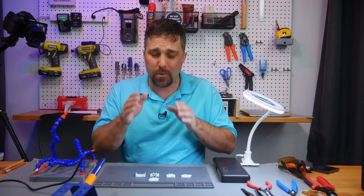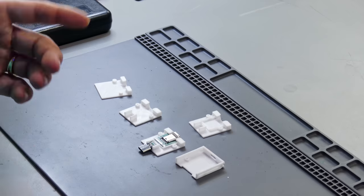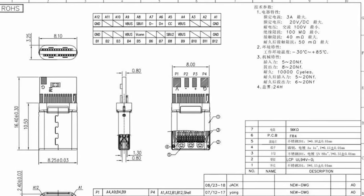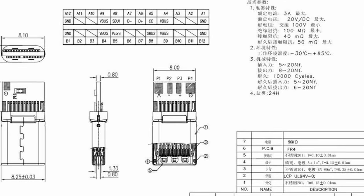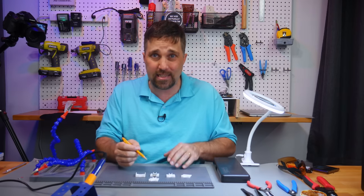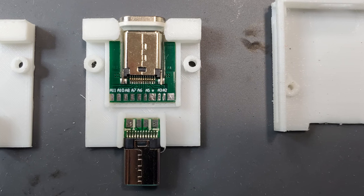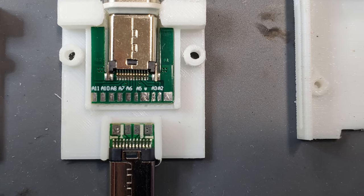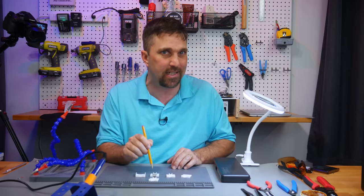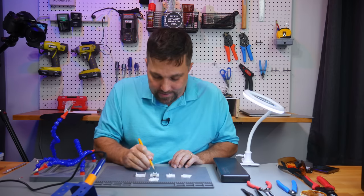I am going to make this work, but only partly because I'm using USB-C connections — they'll be connected as USB 2.0. This PCB only has four solder pads corresponding to the 5-volt pin, ground, and pins A6 and A7, which are the USB 2 data-plus and data-minus pins in the USB-C connector. I just need to connect those to the corresponding pads on the other PCB — which should be fun, as the A6 and A7 pads are about a hair's width with less than a hair's width between them. A lot of you probably know what the limitation of a USB Type-C connection is here — leave a comment before I tell you the answer at the end.